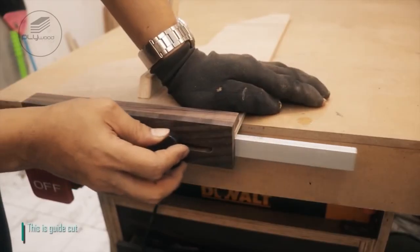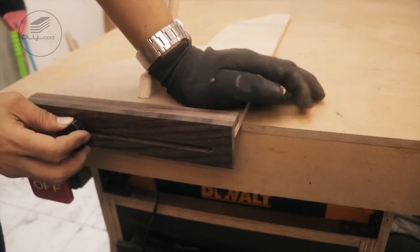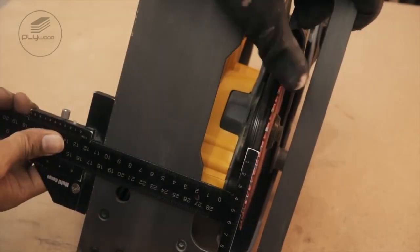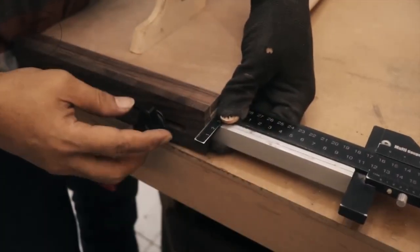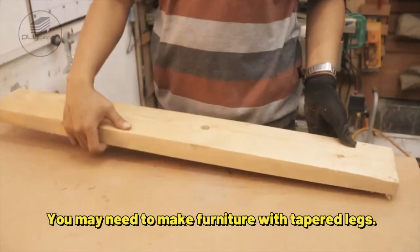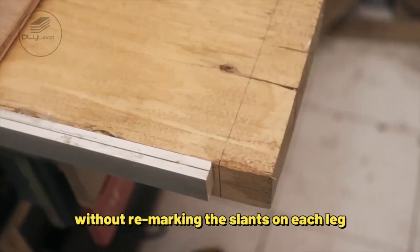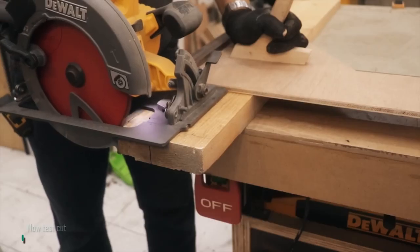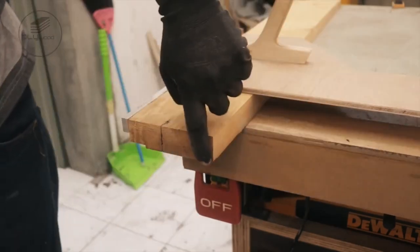The Jig. You don't have to measure every cut and joint if you have jigs. Most woodworkers make their own. You typically use a jig with a power tool to guide the piece through the saw. You can make a jig to cut a perfect circle, or use one to create furniture with tapered legs without re-marking the angles on each leg. A dovetail jig guides your wood as you create dovetail joints.